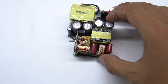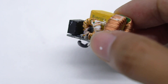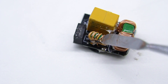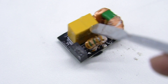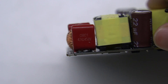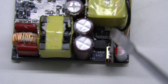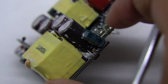Starting from the bottom side, the left side has a small vertical board, and the right side has two film capacitors and filter inductors. Removing the small board reveals a fuse, common-mode choke, and X capacitor. The specification of the time-delay fuse is 3.15A 250V. Wire-wound common-mode chokes are used to filter out EMI interference. The SAFETY-X capacitor has a capacity of 0.68μF. There is a rectifier bridge from WORLD. The two CBB film capacitors have a stand voltage of 450V. This is the filter inductor, and the PFC boost inductor is next to it. There is space between the electrolytic capacitor for high-voltage filtering and the small output board. A transformer is on the other side, and the mini electrolytic capacitor has an insulation tube outside.